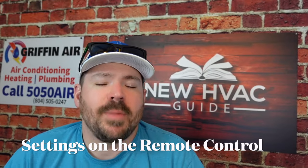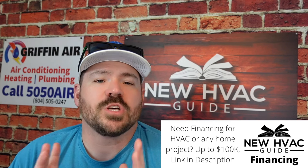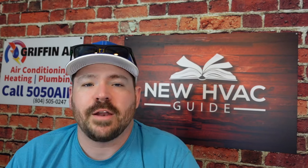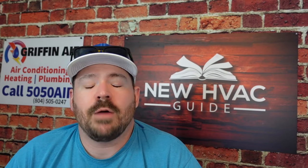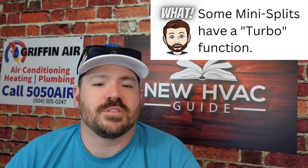Number two: check your remote settings. Make sure you read the manual and understand what each thing on that remote means. A lot of folks will treat a mini split the same way they would treat a thermostat on a conventional system, and unfortunately that is not how you should do it. You don't just put it on cooling mode, set the temperature, and turn it on full speed. Instead, you want to set it up to run as efficiently as possible. In the majority of cases, if I see a homeowner having an issue with their mini split and there's nothing wrong with the system, they simply have settings that are wrong on the remote. Set the speed to auto, make sure your fan is on auto, set your mode, and check the rest of the settings to make sure they are where they need to be.